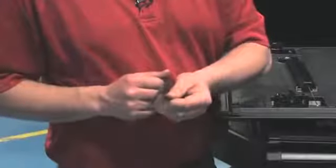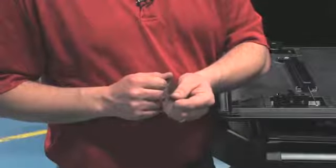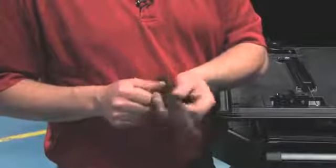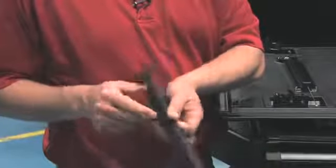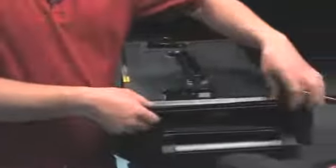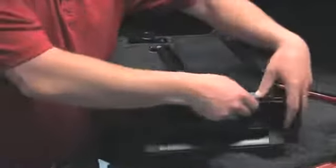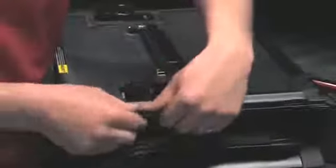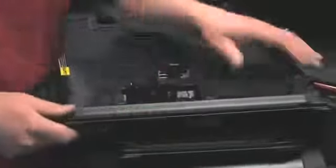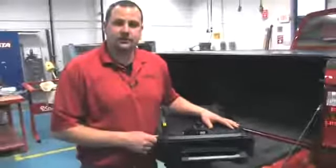The Xtang Encore incorporates a track seal. The two-fin seal will always be placed towards the perimeter edge of the Encore cover, while this seal will be placed towards the inner edge of the cover. To install, simply press the inner edge into the channel, and once secured to the inner edge, press the seal outward until you feel it click into position. Very easy to use and service.